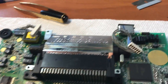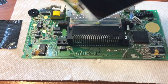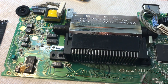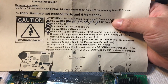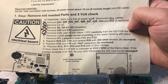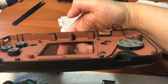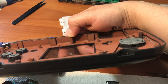I had already gone ahead and removed the screen from the motherboard because it was a pain to work with — I peeled everything off and luckily nothing was left behind, kind of like the Virtual Boy. Next the instructions say to remove the LCD, peel off the ribbon cable — which I just showed you — then remove the middle plastic screw mounting of the upper housing with pliers. What they mean is this pillar here needs to go. I'm going to use an X-Acto knife, a Dremel, and a razor blade to get this filed down.